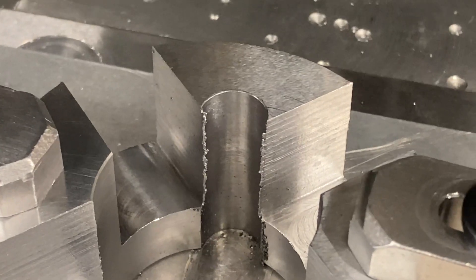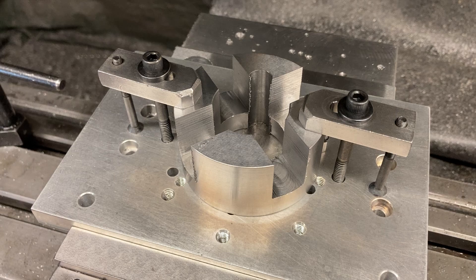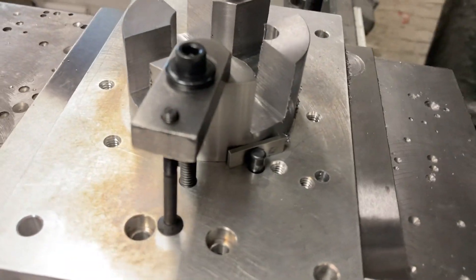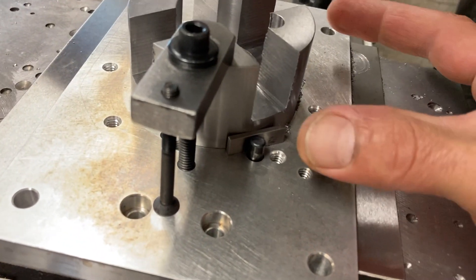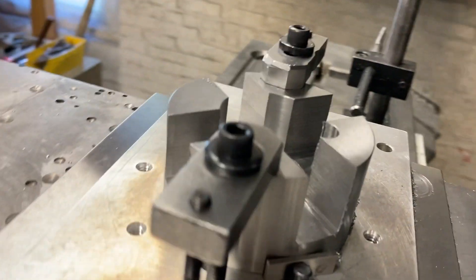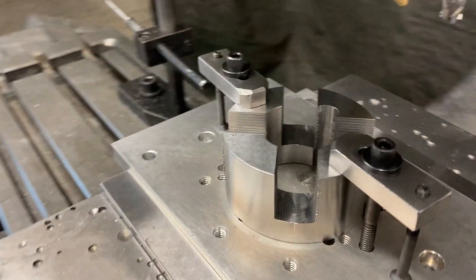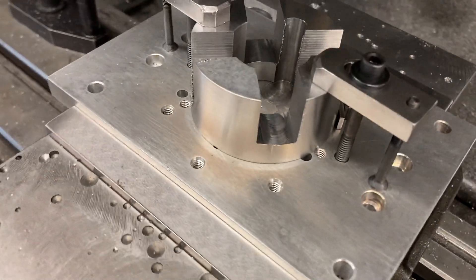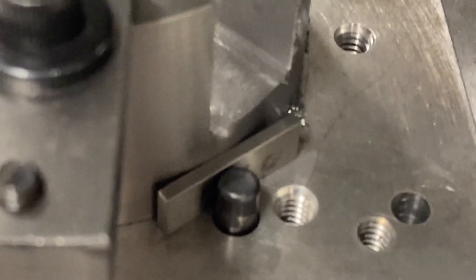Little radius notch out and they're all roughed out. I got it screwed down to the aluminum plate. I got a couple dowels I put in on a bolt circle that essentially made almost like a V-block — with these dowels here, there's one on each side. First piece I did was a larger diameter, so to keep the part somewhat central to the bolt circle, I got the bolt circle here to screw them down.